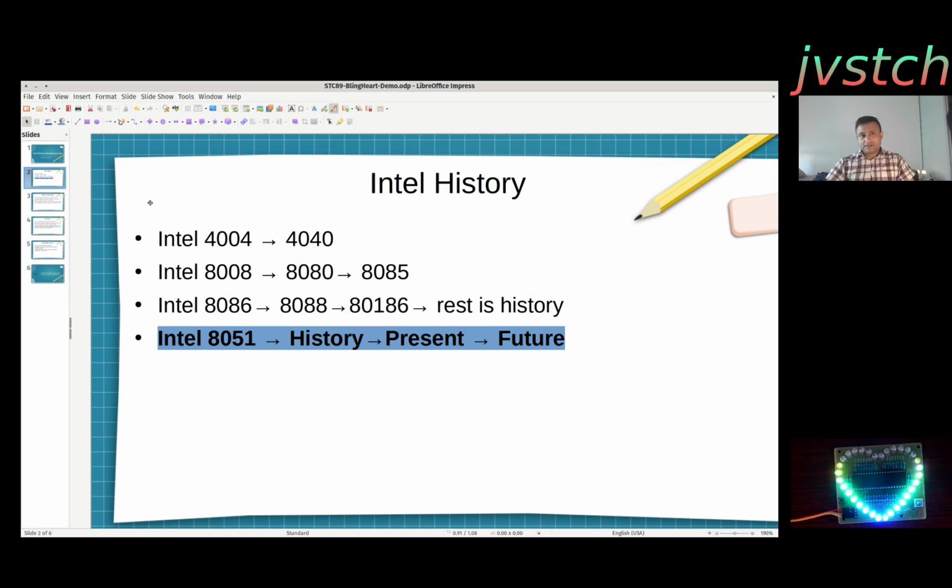then someone else designed a chip called the 8008, I think CTC or some company, and made Intel manufacture it. And then I think someone else again reiterated to make the 8080. I think it's a little bit more integrated. I don't fully remember the variations between these two, but it's an 8-bit microcontroller. And that 8-bit microcontroller, the 8080, needed 12 volt, 8 volt, 5 volt, 3 or 4 voltages to work.